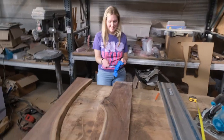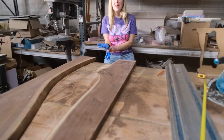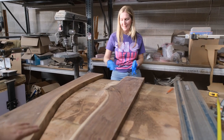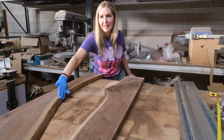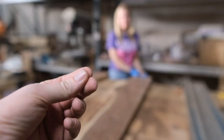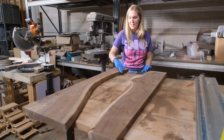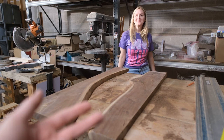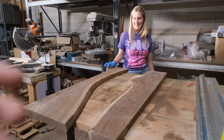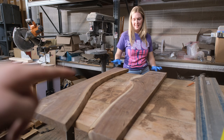Okay, up next. Before we can actually do the pouring of the epoxy, we have to put some temporary epoxy. We have to coat the insides there with some quick drying 24-hour epoxy. The reason you do that is to prevent the bubbles, because there are secret bubbles in this. This thing is filled with air and small, old, ancient wood farts. Once you pour the epoxy in, all these bubbles will start coming up. You can blast it with the heat gun all you want, but bubbles will come out unless you seal it up first. So we're going to seal it up with some 24-hour epoxy, both sides. Then tomorrow we'll do the pour.